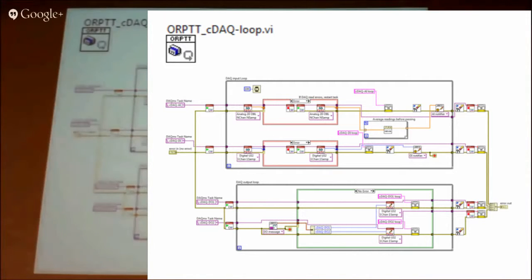The way it was set up — it wasn't that test position one uses the first eight bits and test position two uses the next eight. Instead, the first six lines handle the same function across all the different positions. So it's divided by pin to function, not by pin to position. That's why we had to do some clever stuff to share that out.